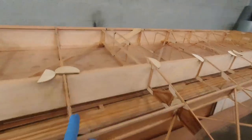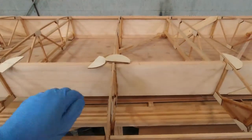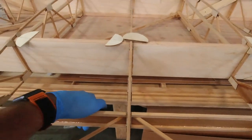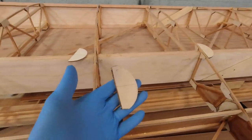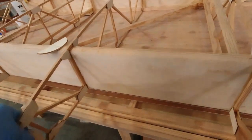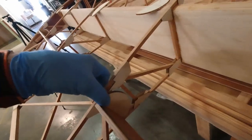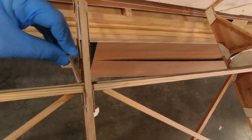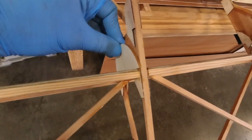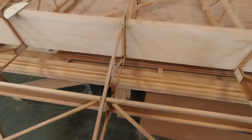And then at rib number 4 and rib number 7, these are the two locations where, when you wrap the plywood around the leading edge, this is the joint at which that plywood terminates. So they actually get the 1/4-inch material centered on the rib. And it's also going to get this rib on the other side that basically gives you 3/8 of an inch at that overlap point. So, plenty of material to glue to where there's overlap.